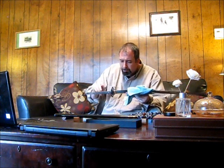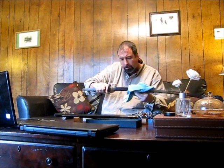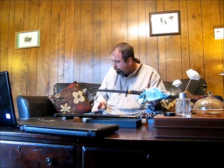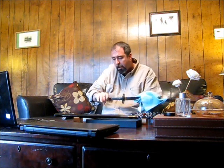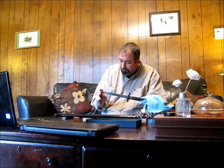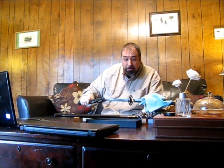When a katana is properly built, the shock transfers down the blade to the habaki, the seppa, and disperses out, not being absorbed by the entire tsuka. So it helps avoid cracked tsuka, stuff like this. You have to look for a flow, for continuity, for a stiffness there, which we definitely see on these Ronin katana.